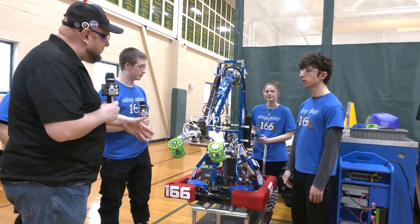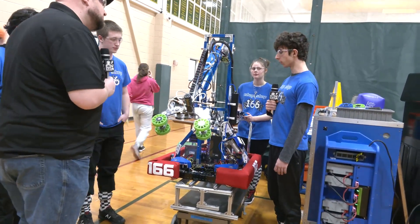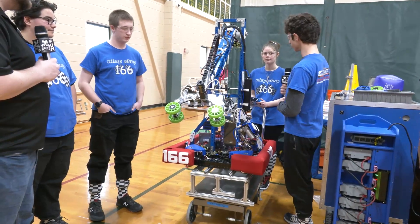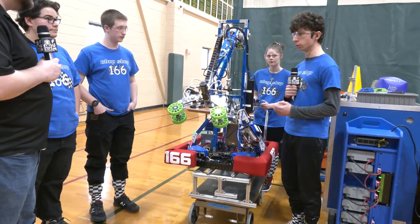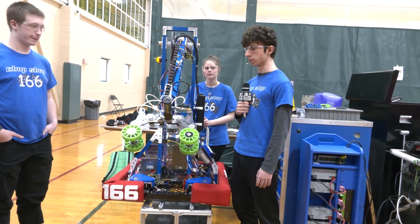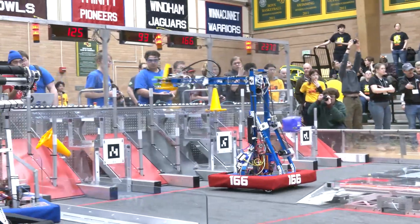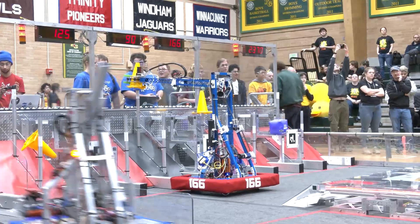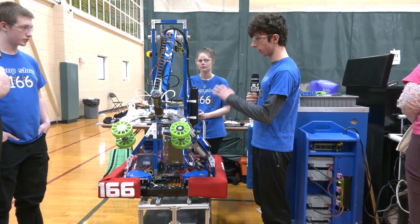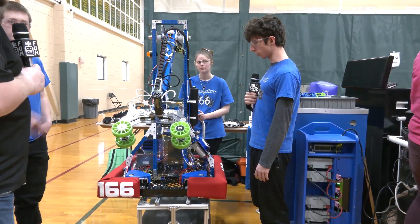Joe, from a programming standpoint, what's going into the robot and what are your future plans with vision? Before week zero we've mostly been focusing on getting integration done for all the parts. We've been using Mechanical Advantage's new logging framework — AdvantageKit along with AdvantageScope for looking at a bunch of data. We've mainly been focusing on safety, adding software safety features like limits — for example, the arm won't go in all the way until the intake is closed, and we've added protection so the intake doesn't slam into the end once it's extended.